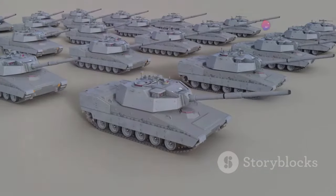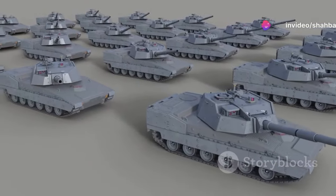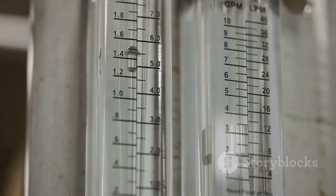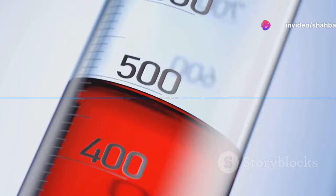Now, once the transmitter is programmed with the tank reference height, typically the bottom of the tank or chamber, the liquid level can be calculated. This is done by subtracting the calculated distance from the tank height. In essence, the pulse radar technique is a simple yet effective way to measure the level of liquids.